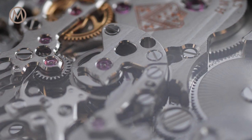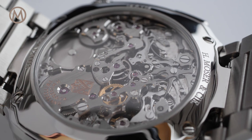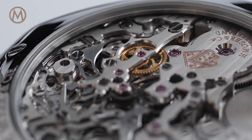Built on two levels, it incorporates a cam storing energy for an entire minute before releasing it precisely when a feeler spindle falls to generate an instant jump of the minute hand. The coupling combines the best of the vertical and horizontal clutch — made horizontally to require less space, yet the connection is made by friction wheels with no teeth, just like vertical clutches, thus avoiding any accidental jump when the chronograph is activated.